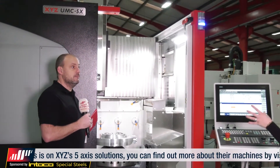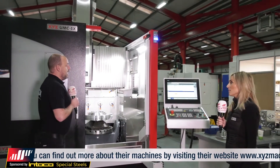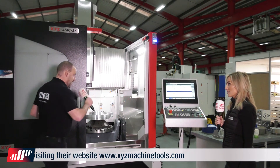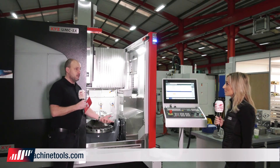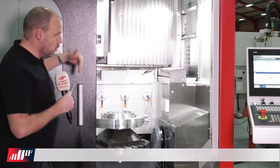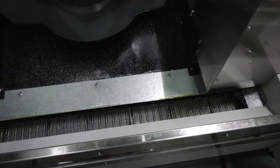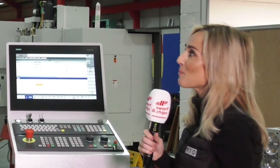The height of this machine — does height come into a five-axis? Height is classed as part of the footprint, and any company wants to reduce that, because you can then get more spindles in one area. This machine is quite short and compact. The swarf conveyor is at the front, so as the table tips forward, swarf will fall at the front — they've considered all of those options.